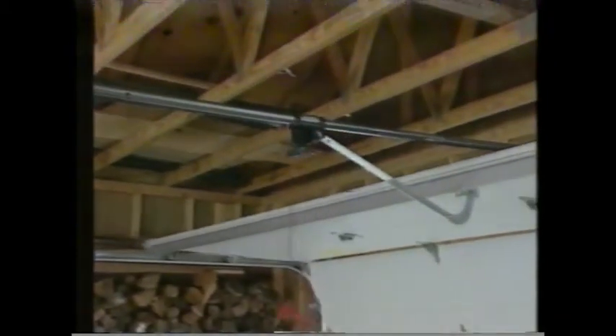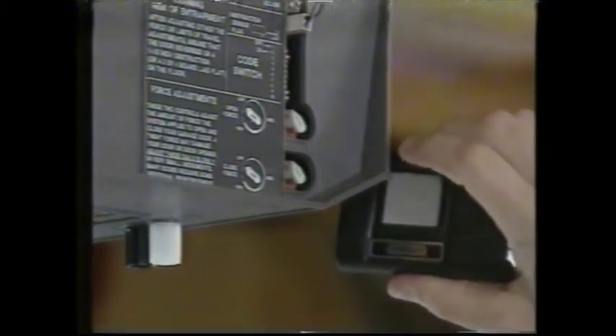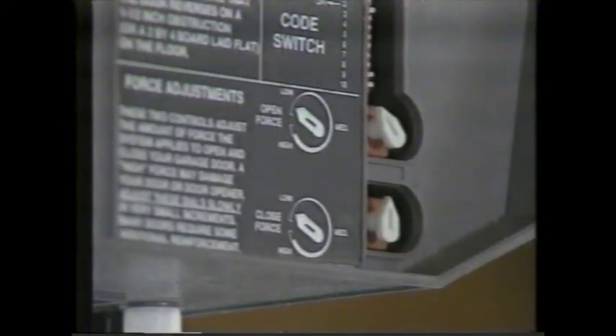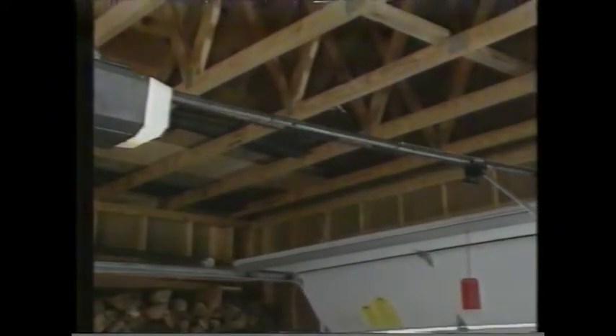The final step in the installation is to reconnect the traveler to the carrier — just pull down the emergency manual disconnect and open the door. Your opener is designed so you can customize the amount of force the power unit applies to the door by adjusting the open and close force knobs. Hit the transmitter to start the door closing; the door should move about two feet with the preset minimum power. Start with the closed force knob, turning it one-tenth of a notch at a time. If the door starts to reverse, increase the closed force slightly in one-tenth increments. You may also have to increase the factory preset open force — if the door stops when opening and the lights blink, increase the open force by turning the open force knob in one-tenth increments.